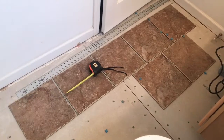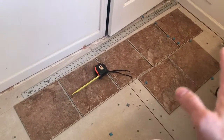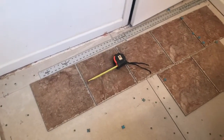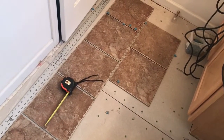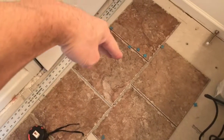You know, take another hour out of your day just to dry lay, or at least like 30% of the room, or get an idea of where all the tiles are gonna lay when you're done. Because it's gonna be permanent once you put them down, or else you're gonna have to start all over. So hopefully this video helps you out and gives you some tips. I think this is a really cool design, the offset.